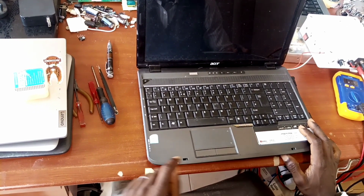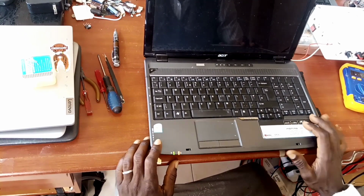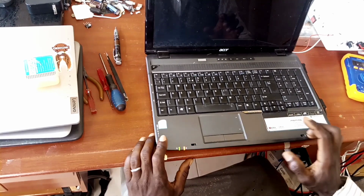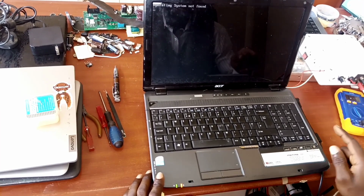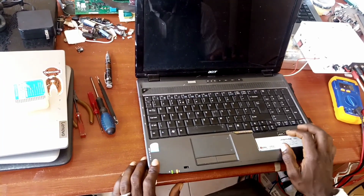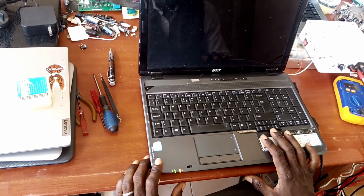And then take note, the diode we mentioned that had that issue, we couldn't get a replacement for it. So what I'll just tell the owner is to ensure we get a power surge protector that will protect against too much voltage, over voltage that can damage the board, because the protection is gone. So we need to employ an external protection, which is the power surge protector, which will arrest any voltage spike. I think that will be my recommendation for the client, so that they can continue enjoying the system without any further damage.